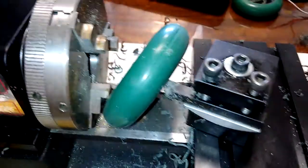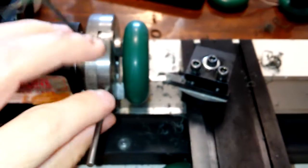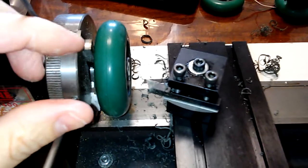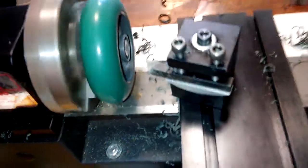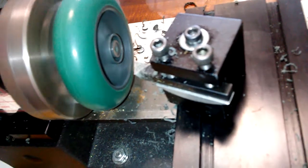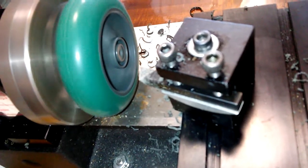I'm going to put the phone down while I chuck it up. I'm not going to invert my chuck — instead I'm just going to put it right over here and expand the chuck so that it'll hold it on the back side. I got it on there — this is my tommy bar and I use that to help tighten the chuck up so it will hold the wheel. Turn the lathe on, you can see it spin, and it looks pretty flat.